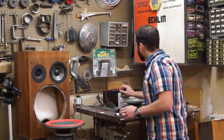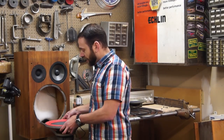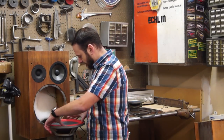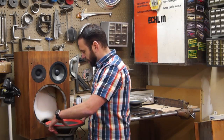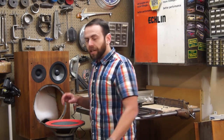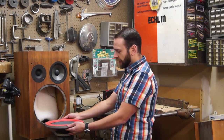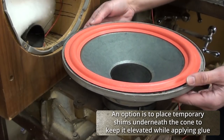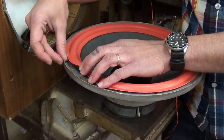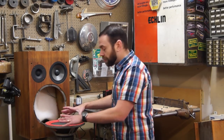We'll turn this on and start playing our tone. You can hear a terrible buzz if it isn't set right. If I have it in the center, you don't hear that buzz. So now we're ready for the glue. What you can do is lift up and apply the glue around, or just carefully peel it back, apply glue to the metal basket, then play this test tone to center it.